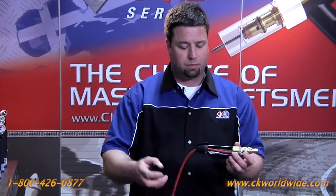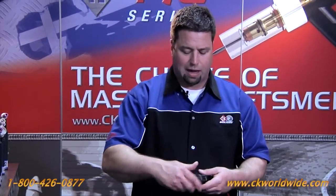In the back of the connector you have your connection point for your water cooled TIG torch. On the back of the connector is also a six-foot water hose that goes to the water return on your water recirculator. To reinstall, simply put the phenolic shell back on, screw the cap on, plug it into the front of the welding machine, and you're off and running.